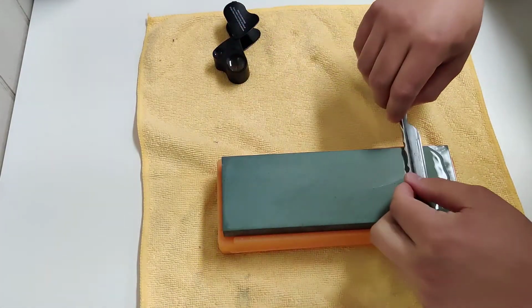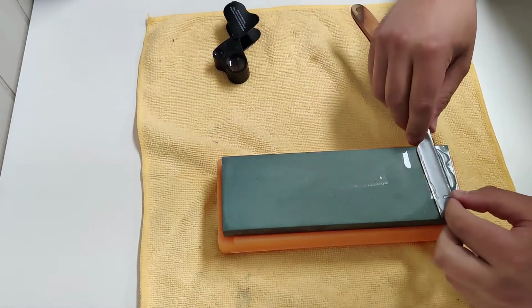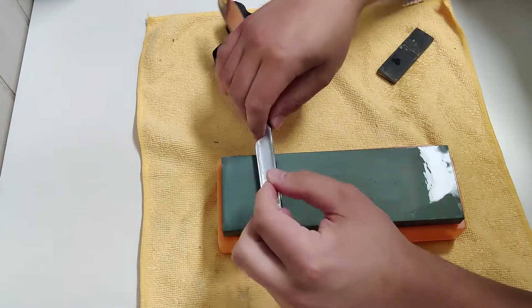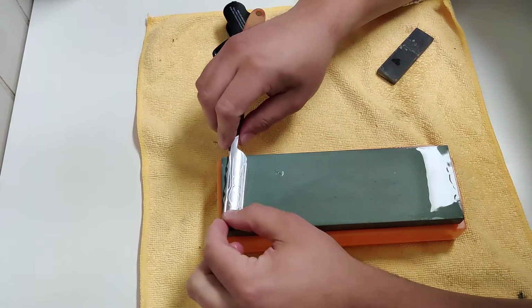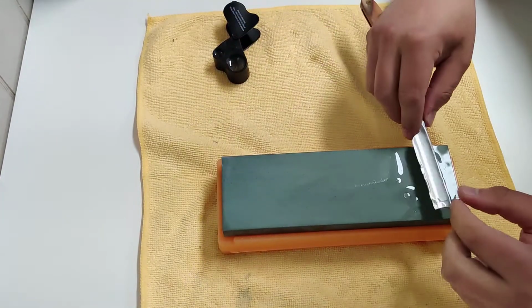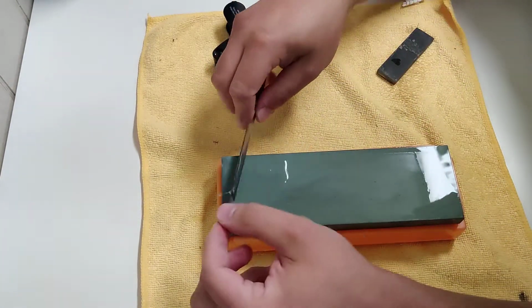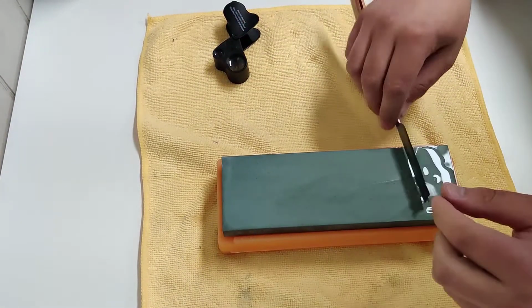In case you guys are wondering, the slurry stone I'm using on these synthetics is a piece of Arkansas stone. They make a great stone for slurrying your base stone because they're so incredibly hard. They don't really give up much in particles on their own. Pretty much the only way you can get an Arkansas stone to slurry is by using a diamond plate, which makes them a wonderful candidate for this kind of work.